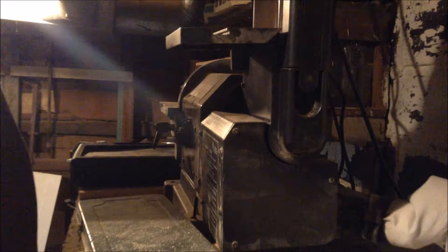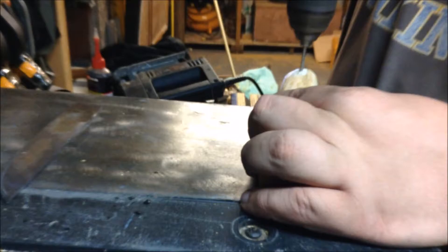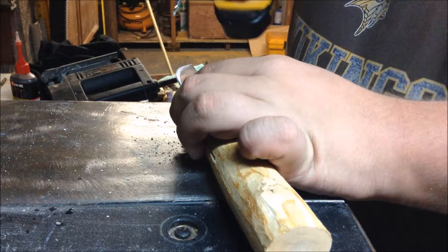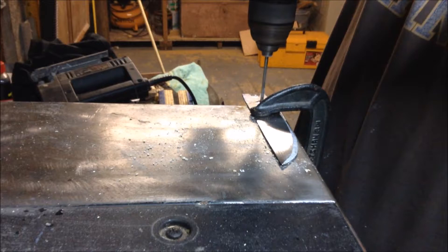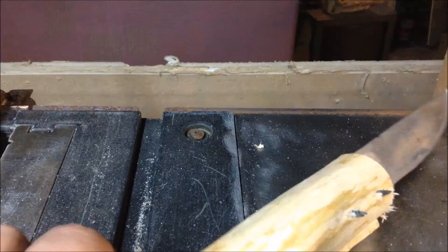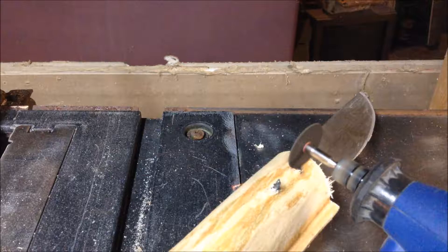I didn't move the camera up the whole way like I should have, but that's what the blade looked like. The next thing I did was drill two holes for the blade to get hooked into, and I marked on the blade where I needed to drill. As I was drilling holes my camera decided to fall. Then I countersunk the holes for the screws, and ground the ends of the screws off because I didn't have any that were short enough to fit correctly.